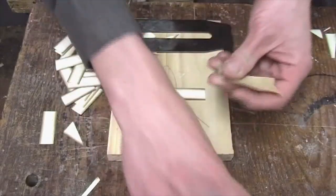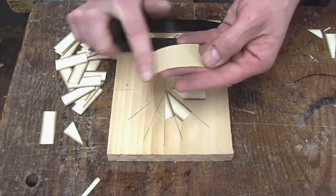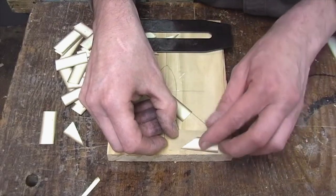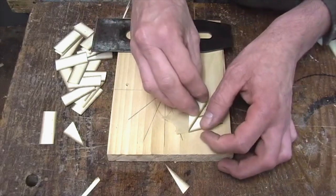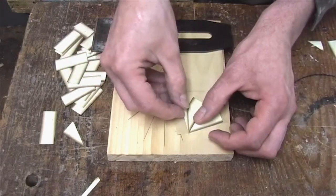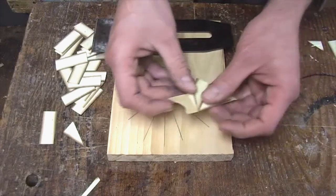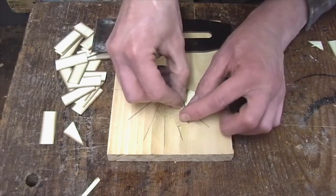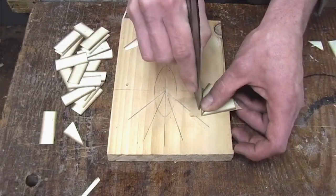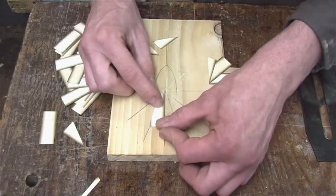Now I'm going to take a piece of veneer tape and lightly mist it with water. I want to rub the water around a little bit — I don't want a lot of excess, but I don't want to overdo it with my finger because that will remove some of the adhesive from the veneer tape. Place the pieces on here keeping them in the same orientation, making sure they all come up clean at the points and that I have a shaded-to-unshaded edge. That one's not right — let me pull that off. Okay, that looks good. Now I'll cut away the piece of tape that's overhanging.